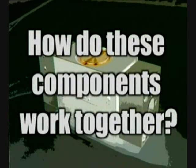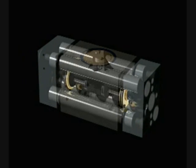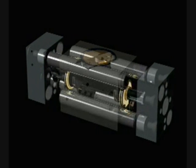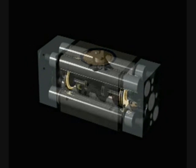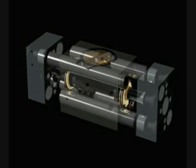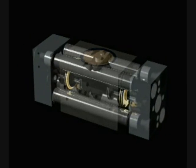How do these components work together? Internally, pneumatic pressure drives both pistons, each of which is attached to a jaw, providing an efficient direct transfer of power and eliminating failure points. Two jaw guides, each of which extend through the entire length of the body, support each jaw — a very simple process that results in a powerful and reliable gripping action.